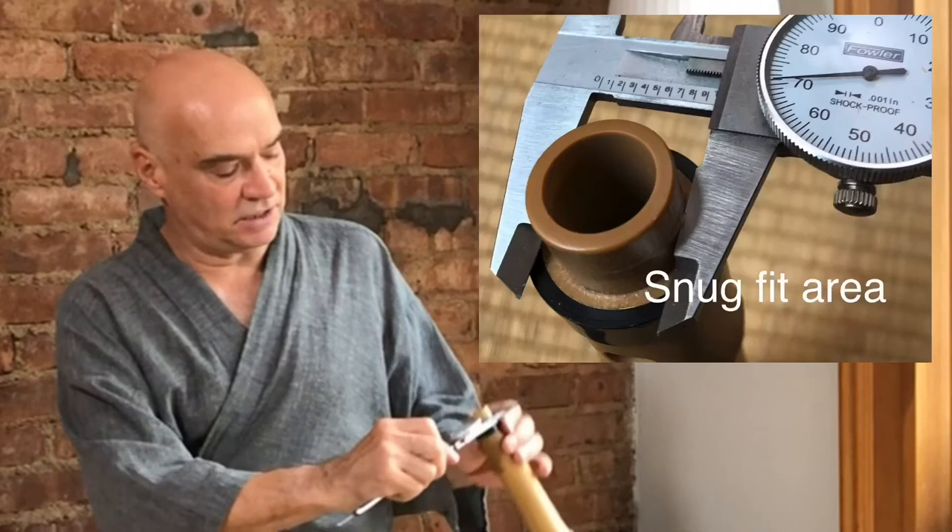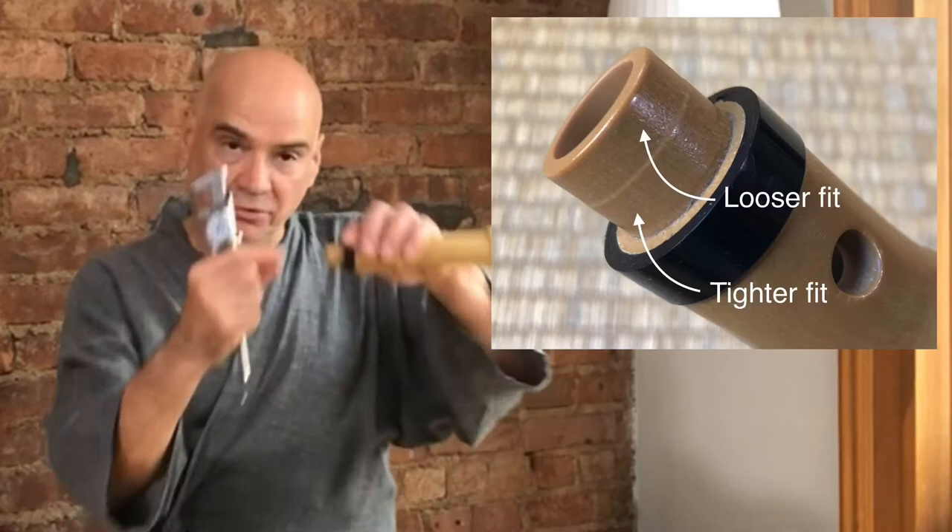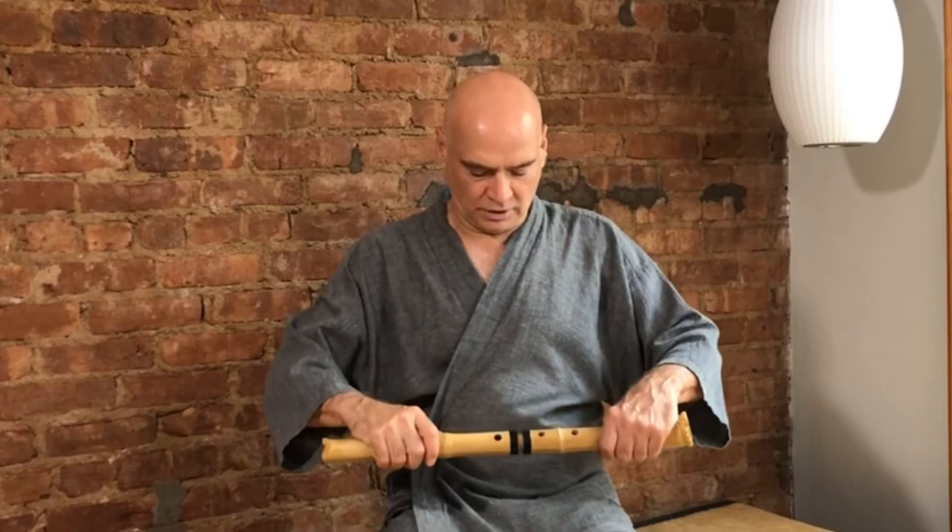The joint here is made with such precision — it's a little wobbly, but when you push it together, it snaps together very nicely. The engineering is so precise that, as a former plastic engineer, if I take my micrometer I see it's 0.975 inches here, but right where it goes over the edge and fits into the lower half, it's only 0.960 — which means it's really designed to be opened and closed on a regular basis. It goes on loosely and then snaps tight.